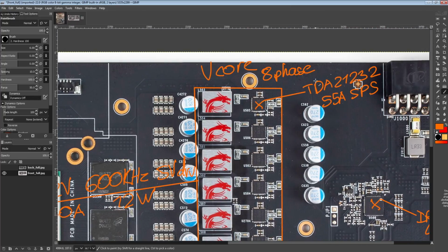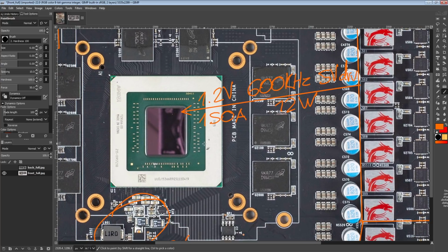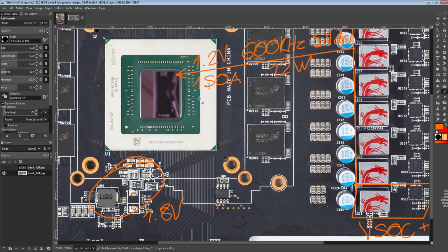There's a lot of smart power stages where they're spec'd at 1.8 volts, and if you're not building a Xeon based system, it's completely useless to have a specification in 1.8 volts, because nothing runs on that except Xeons and Intel CPUs with integrated voltage regulators. So mostly Xeons, right? And then I guess you can count the Skylake X and the Cascade Lake X CPUs as well, but those are just chopped up Xeons in disguise for consumers. So I count those as Xeons.